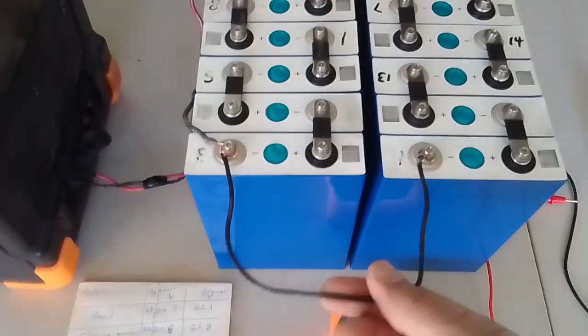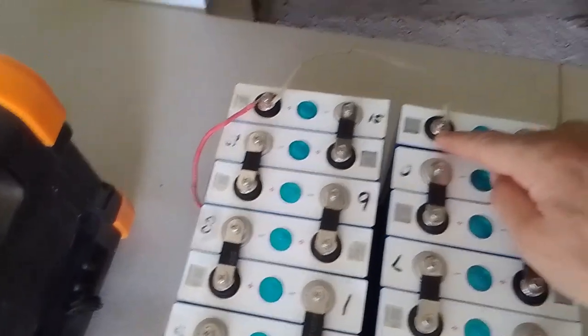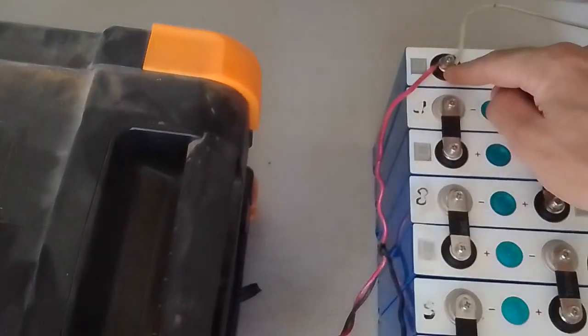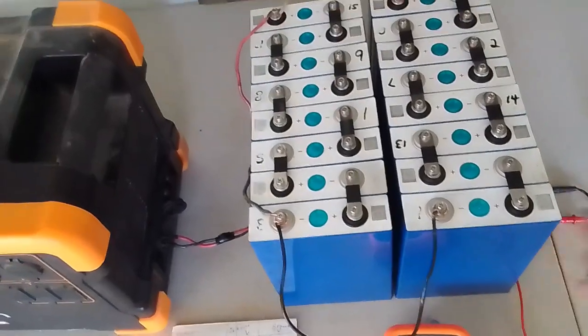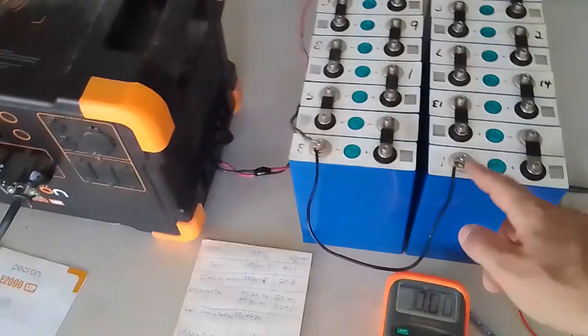Second weakest, and more importantly, is just my paralleling jumper wires. Big enough wire, but I really need to get some ring terminals and properly crimp those on there. I wouldn't solder — I'm not a believer in solder. Just crimp some nice rings on there. I used my charger, hooked it up as battery input, charged this one up, and brought them both to about the same voltage. Not too hard because the voltage is so close through the whole middle of the charge — these will happily balance themselves together. The secondary pack was even a little bit more charged than the ones hooked up already, but there was no sparking and these didn't warm up at all when I connected them together. So we're just happily charging.